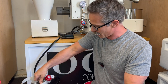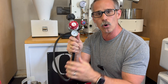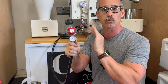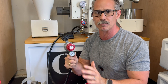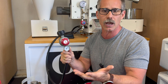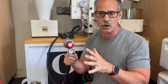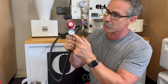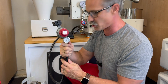The first thing you'll need to do — I'm going to take this off a little bit so you can see it better — you're going to want to order a higher PSI regulator for your roaster. You cannot use one that's for your barbecue; it doesn't have enough PSI, not enough pressure. You need something that goes up to 5 PSI. I got a 30 PSI. They sell 20, and I think they might have 10 PSI regulators. I got this one because it has this little thing, and I recommend getting it with this — I'll show you why in just a second.